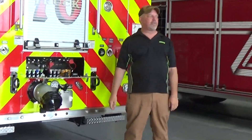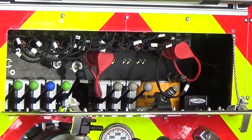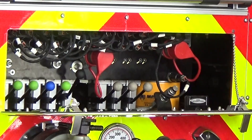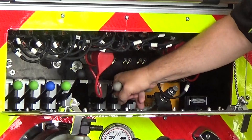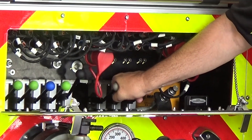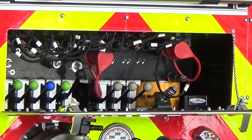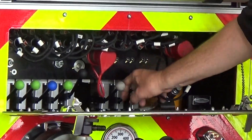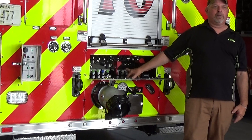These are your global overrides for your hydraulics. If you lose electricity and need to pack this truck up, this is like pulling the handle of a log splitter — you pull the handle, it moves. Nothing is going to stop it. So if I'm rotating the ladder at a low angle and coming in from the side, it's going to continue and hit the side of the truck because there's nothing stopping it. You're telling it it's okay to do that — you're giving it the fluid to do what it's supposed to do. The program is not going to stop it because this doesn't go through the computer. This is just pure hydraulics. Remember, when you're in here, you can wreck stuff. There's nothing going to save you.